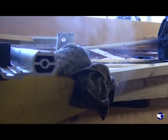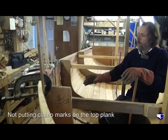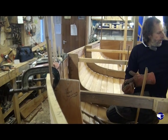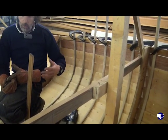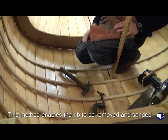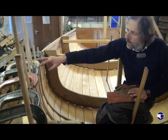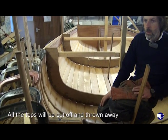The other good reason for having the batten round is that obviously we aren't putting clamp marks on the top plank, but also the oak is going to get really badly stained where the clamps are, because the tannin in the oak reacts with steel and goes black or dark purple. You can see just a few black spots and slightly purple stains on the ribs, just through the steaming process. Doing it like this gives us a chance to take the rib out, give it a good going over with sandpaper and hopefully get rid of most of that staining, because the inside of the boat is going to be varnished. And where the ribs are stained by the clamps up here, all that will be cut off and thrown away — so that works well on every angle.